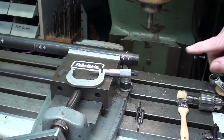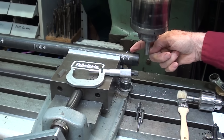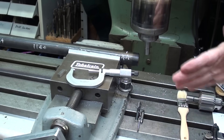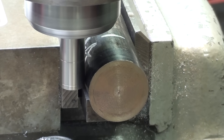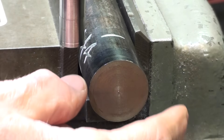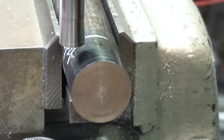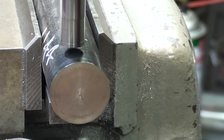The first thing I want to do is take my edge finder, which is half inch, touch off, and find the middle. Once I do the touch off, it'll be 842 thousandths over and I'll be on the middle for the remainder of the project. I've touched off, and now I'm going to move the table over 842 thousandths — that is the radius of the bar and the radius of the edge finder. Looking at the DRO and moving 842 thousandths, now I'm in the center of the work. I will lock the table and it will remain there for most of the rest of the project.